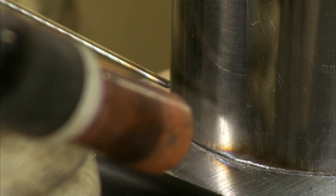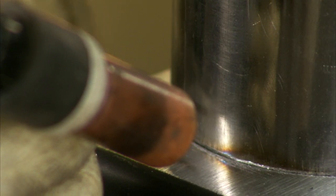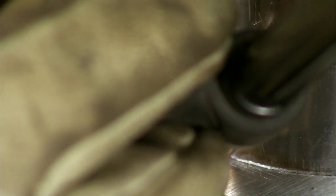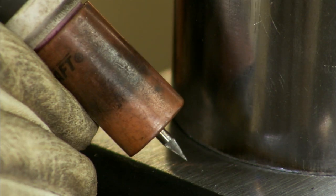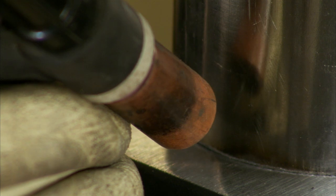The type of weld I've chosen for demonstration purposes is a fillet weld — this is the easiest weld to make look good. Notice the angle of my torch: it's pretty much straight on. That means it's not laying like this or like that, and that's what's going to help me make that round shape, going straight into it. Here we go.